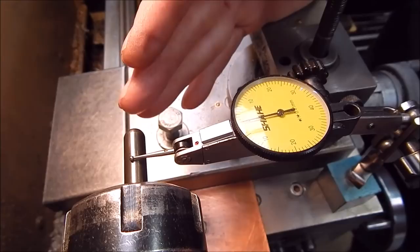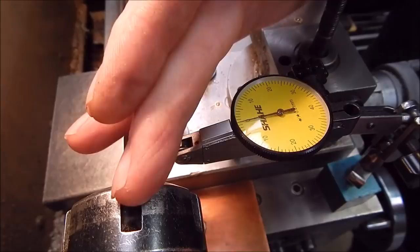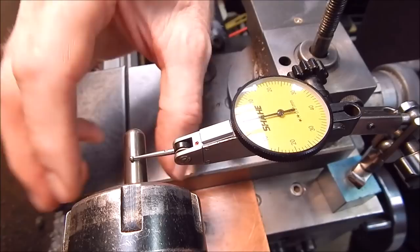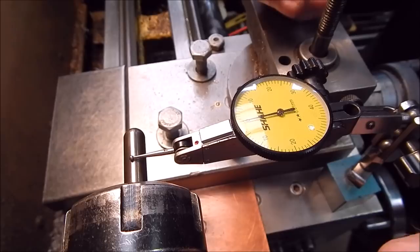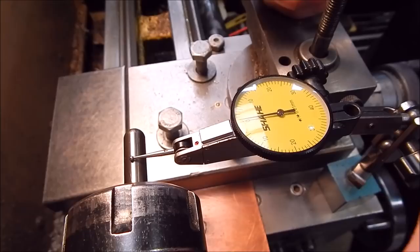You'll get the negative because they can't offset each other. It doesn't matter which way around you go — whether it's the most accurate collet or the most accurate chuck, if the other party isn't accurate, the error factor will always remain the same. But in this case, we've got two inaccurate — not massively — but two inaccurate components: the collet chuck and the collet. If you can identify where the error factor radially is, you just do it by taking a measurement, then loosen off your chuck and rotate the collet through various positions. I always go 180 degrees and see what effect that has. Quite often you get lucky, but you might have to go a third of a turn or a quarter of a turn. Look at that — we've done a good job. It's now in a usable, pretty accurate state.